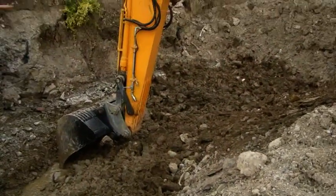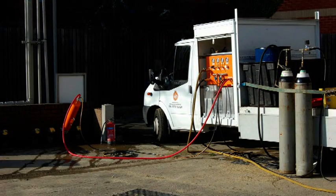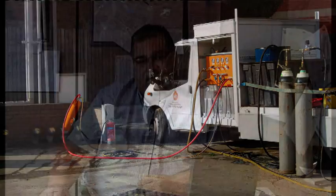Nitrofoam inerting is a precursor to the cleaning and gas freeing of a tank and then the subsequent excavation of the tank from there. We have been doing nitrofoaming for many years, but we realised that we wanted to produce more consistent and higher quality foam. Before it was a modular system and the settings would have to be adjusted to produce the foam that we wanted. But having combined it into a fixed unit on board the vehicle, we now feel that we are much more consistent and therefore the quality of the foam is always constant.